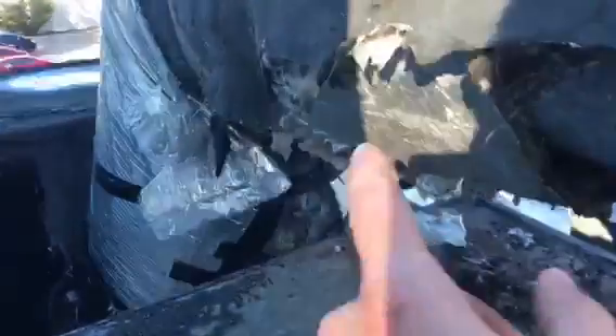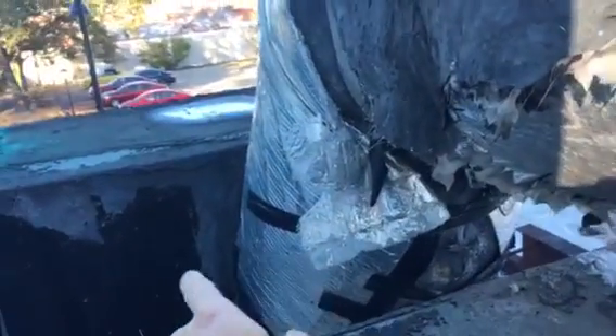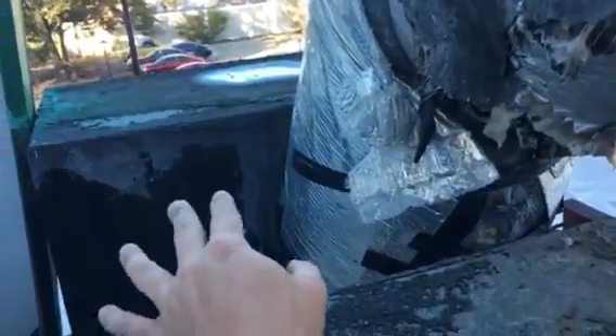The same thing's going on on that side — if there's any insulation exposed on this thing, it's going to get water and that water is going to automatically go downhill and into this box and collect in there for a long time until it spills over. It'll only happen every so often; you have to have enough rain for it to show itself on the interior.